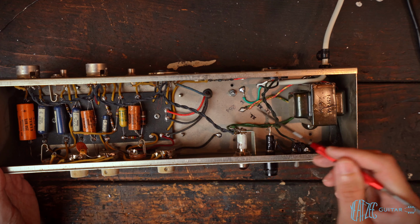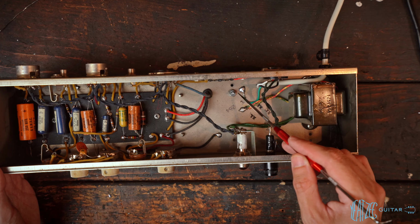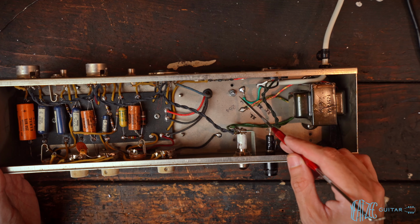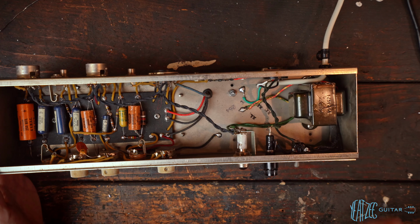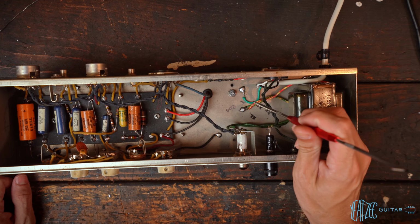Another option is this kind of complicated diode terminal strip resistor network, going back to what was in here before, but it actually wasn't done correctly. It should have a resistor there as well. That's one possible solution, but in doing that, you're also partially losing the safety from the ground.